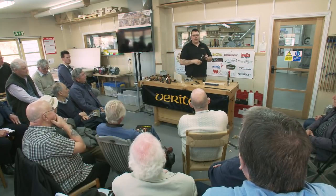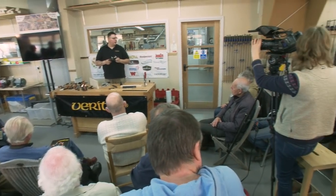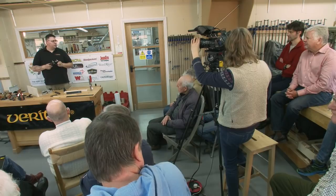I was just trying to think in my head where that would come up, but I'm not a marquetry specialist, so I don't know for sure, but I would think that the next plane that we'll talk about is probably going to do the trick for you. I think if you were doing a line all the way down the length of timber, then as Vic's just shown, it's really quite quick and easy to do, but I think going into a blind corner, stopped at each end, then you're going to struggle. Yeah.